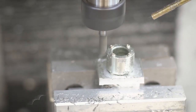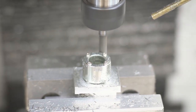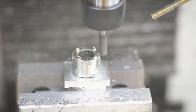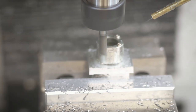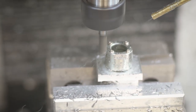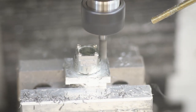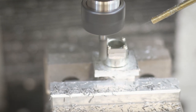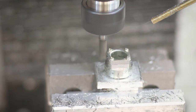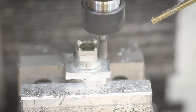I ended up doing a total of four of these rings. Once I figured out the x-axis issue I just oiled it up well and didn't have that sticking problem anymore — we'll see if that persists. The other three went just fine. I was able to get out of the way and get some really nice footage of the cutting. It's pretty straightforward — the others ended up cutting well at around four minutes per part, so not a big deal.